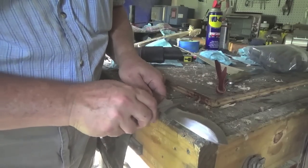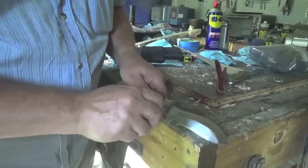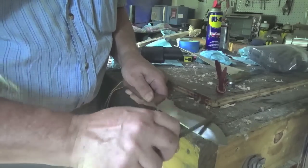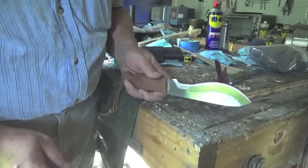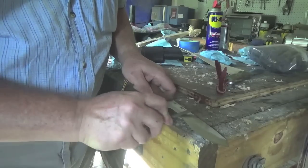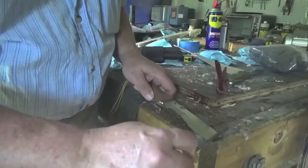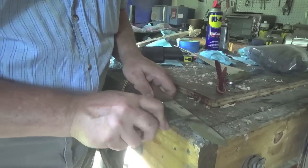Here I am sharpening it. There's been some concern over how easy it is to sharpen and maintain, so I was demonstrating how I do it with a diamond rod. And you can do some touch-up work with a ceramic rod, and it'll do the same thing. It's really not much different than sharpening a cook's knife. You just need to make sure that you follow that 11 to 12 degree Scandi all the way from the back curve to the tip of the knife, because that same degree bevel follows it all the way through. So once you get your angle right on the Scandi, you just follow it all the way through from that point to the tip. It's very simple.